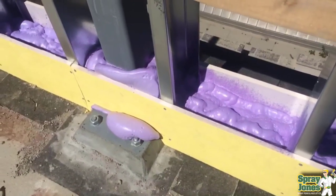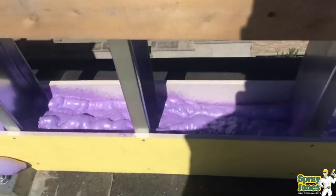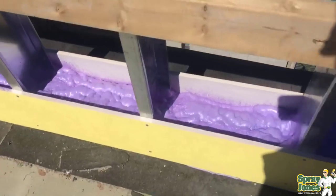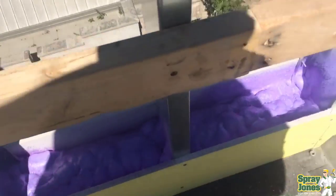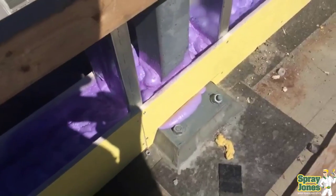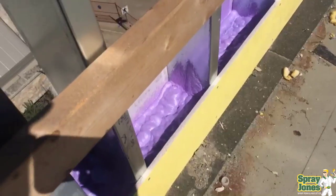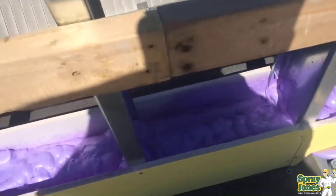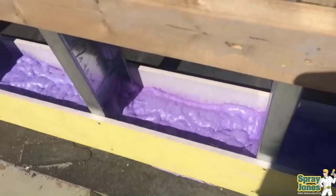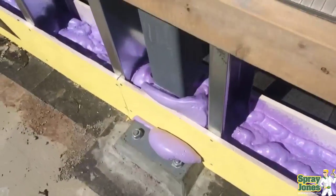A lot of times they'll ask us: can you do this just with spray foam? The answer is no — we can't inject foam into the column with spray foam because it wouldn't flow to the bottom; you'd have gaps and voids in it fairly heavily. You need to do it with a liquid pour foam and then switch out. It's right product, right application. We've done 12 by 12 HSS and even larger columns inside buildings that would otherwise be thermally compromised without insulation in them.